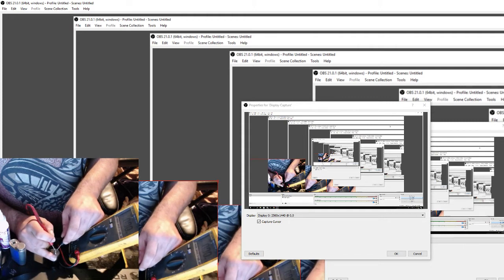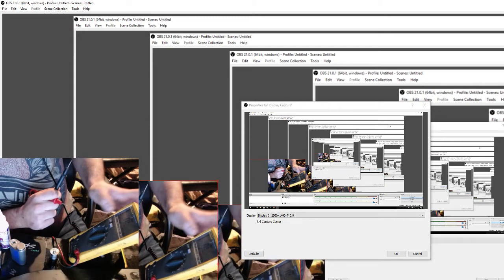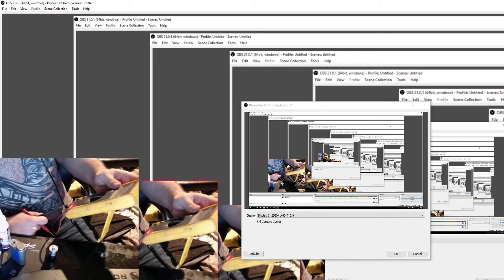Now, once I've zeroed them out, now it is safe. Positive, in my case, red, most often red on the positive pin. Negative, on the side threads. It's actually trying to register below 1 deci-ohm, so I'm going to manipulate the range because I am going to need milli. It's very simple. All you need is steady hands. Remember, red touches positive. Black touches the threads. It's negative. Should say 0.5.